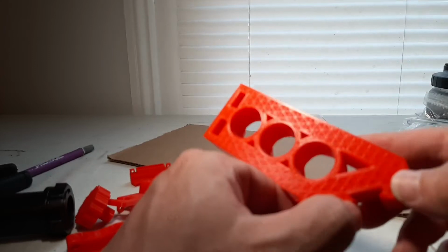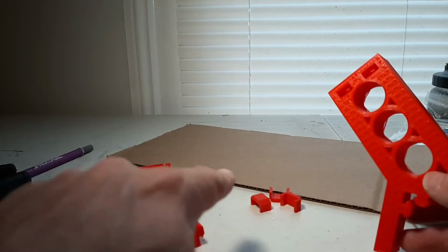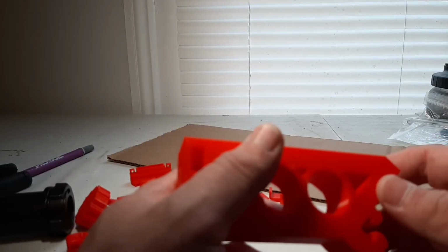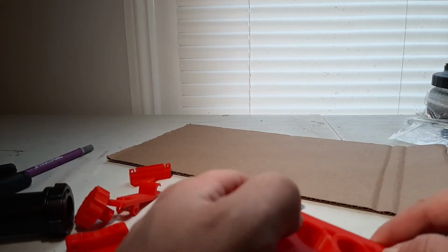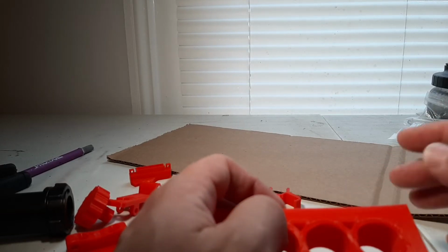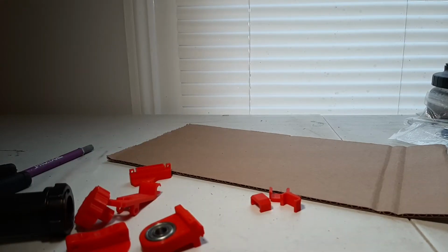This way you can move your spool to the side of the machine and have your filament go straight into the extruder, rather than going from the top and having to loop down and around and have all sorts of awkward angles. I had the filament snap on me, oddly enough, both prints were at the 2-hour mark, and the filament just snapped, and it basically caused the print was no good by the time I realized that the filament snapped. If I realized the filament snapped right away, I could have paused the print, pulled the filament out of the machine, and refed filament in, and continued with my print.